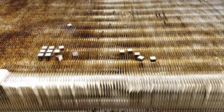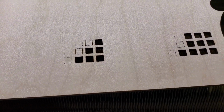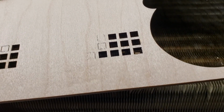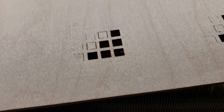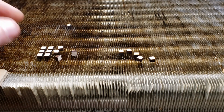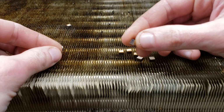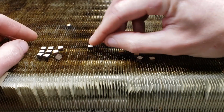It's not a question of if you should have Air Assist, it's a question of what's the best Air Assist I can get and how can I make it better. And I hope y'all are learning how to make it better in this video. And I'm going to try and show the sweet spot for a number of passes I feel is about 4 to 5. And with that you can get much cleaner looking sides.